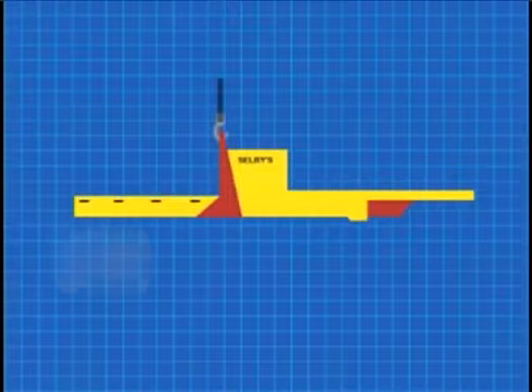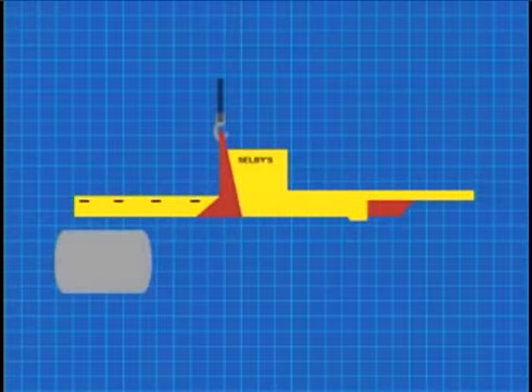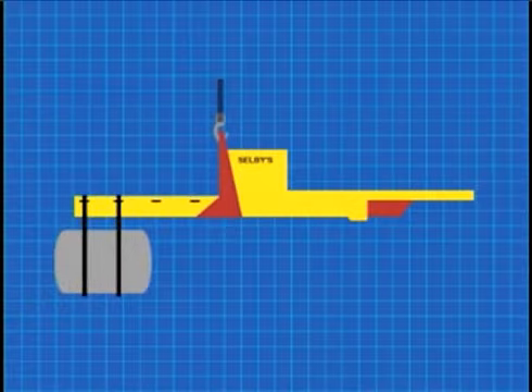Here's how it works. Material is attached to the load end of the arm. The operator uses a wired handheld control to extend a lead counterweight on the other end of the arm to establish equilibrium. The balanced load is now ready to be lifted and steered into position.